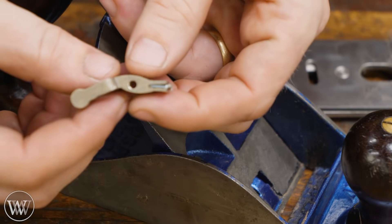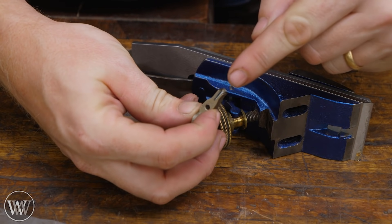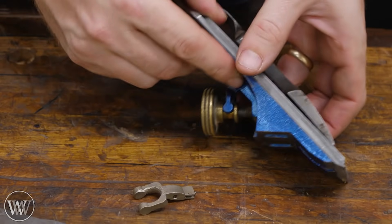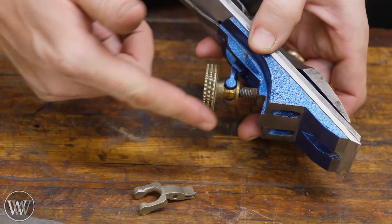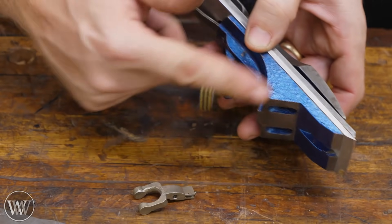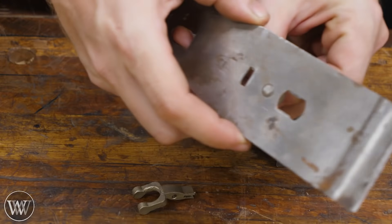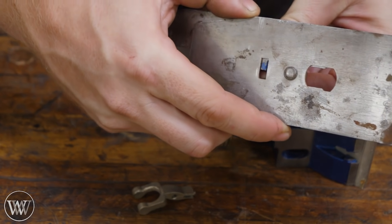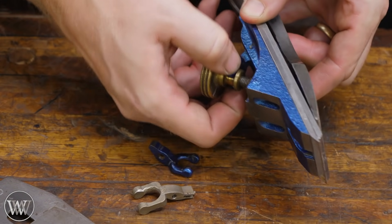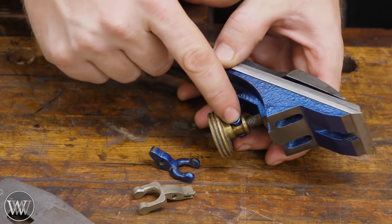If that's not enough, he wants to take it one step closer with a split yoke. The split allows you to drive a screw down in and adjust how fat it is. Because the problem is that a lot of these planes have two and a half rotations until everything engages one way, and two and a half rotations the other way — and there's a lot of slop in there. The slop comes from several places: the yoke can be too small and bounce back and forth in the slot; the hole can be too big with a lot of wobble on the pin; and the round ends aren't quite fit for the hole.